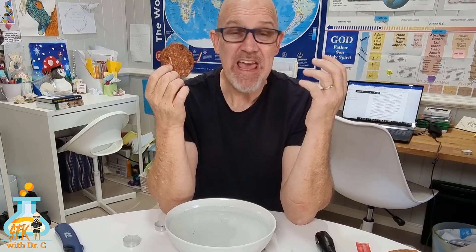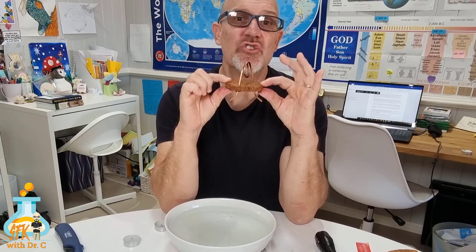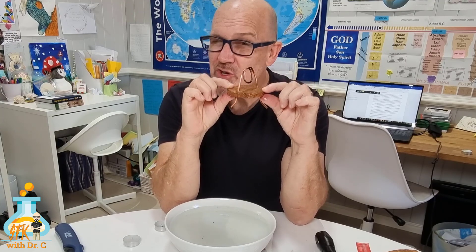That steam makes its way through our copper tubing, and when the steam molecules hit the dog leg right here, that causes the steam to push on that copper tubing in that direction. On this side, the steam hits this part of the dog leg and causes a force pointing in this direction — and that causes the object to spin. That's your heat engine. Every single heat engine works in exactly the same way — that's how steam engines work and how the engine in your car works. Whether it's this or an internal combustion engine, all heat engines work on that same principle of heat being transferred from hot to cold, with the molecules pushing on something to produce work.